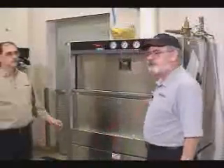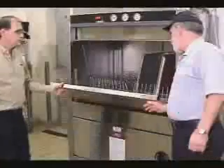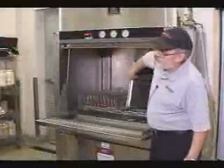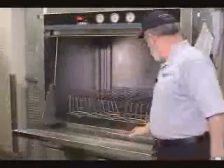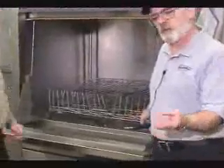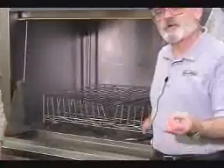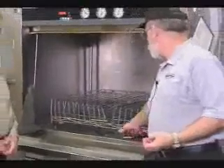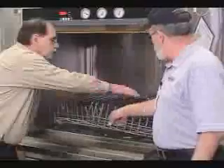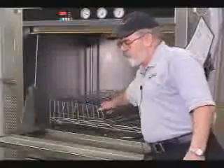At this point we are going to cover cleaning of the machine. We are going to open it up — the fans are clean. You want to check and see how dirty your water is. I can't tell you how many wash loads you'll be able to do; it depends on what you put in the unit. When you reach a point where you cannot see through the water to some extent, it needs to be drained and refilled. To make cleaning easier, we'll be taking out the individual components — everything just slides out.